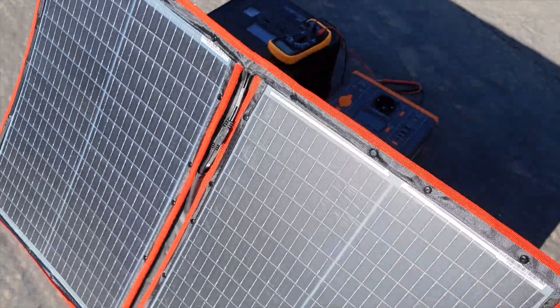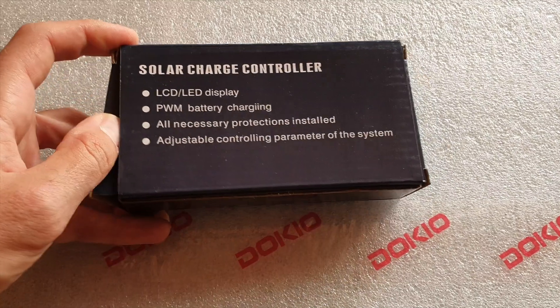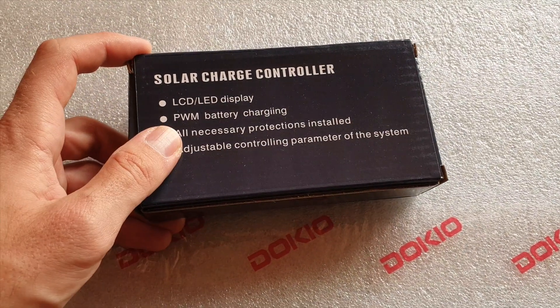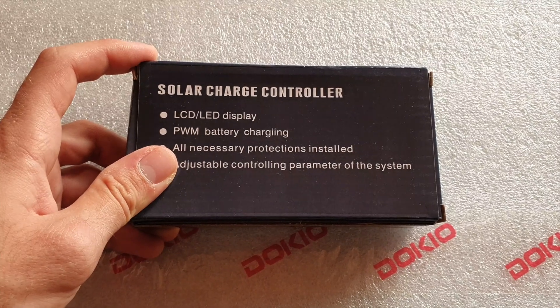On the fabric there's a small gap where you can have the cable pass through the material, so the cable isn't sticking outwards in front of the cells — it goes behind the cells. Maybe that's why they chose an SAE. What's kind of cool with this panel, which you don't get with a lot of other panels, is that you get a separate charge controller — a PWM, not an MPPT charge controller.